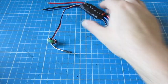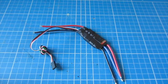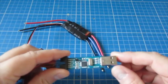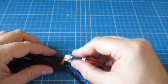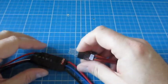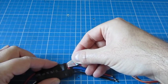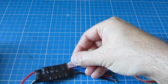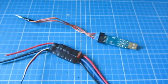So what we'll do next is have a look at the actual software that you need to run. I'll just go through it — what I'm going to do is plug this USB ASP into the computer. Then, because these are slightly flexible pins, I gently apply some pressure, make sure that the pins are sat exactly on the pads, just hold them like that, and click the button on the computer.